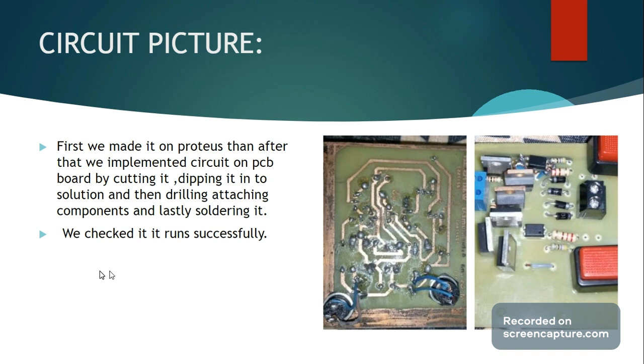We started our PCB, but evidently there was an issue in the soldering, possibly an issue with dry soldering. We checked continuity multiple times. It wasn't short anywhere, so that seems to be the only plausible issue at hand, and we didn't get to resolving it.